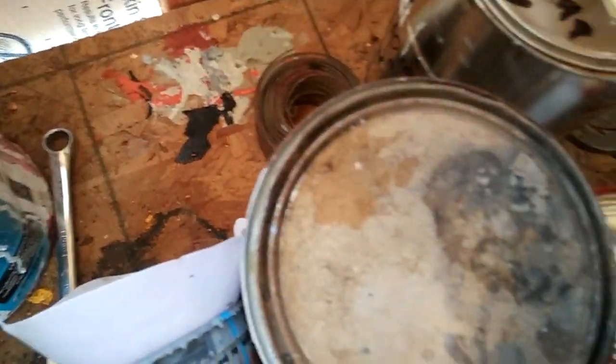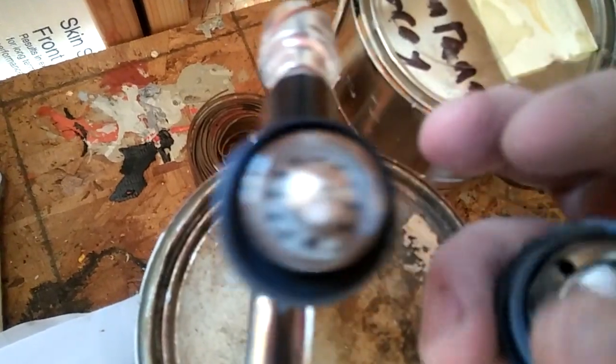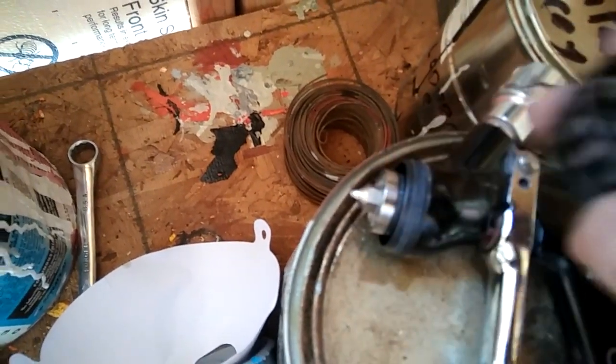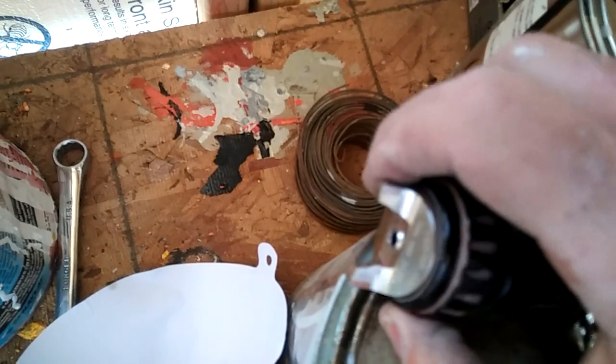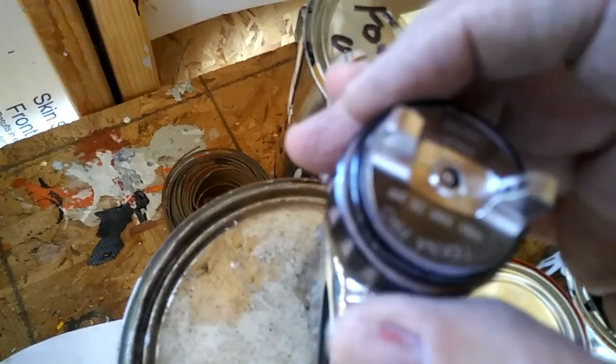Let's also look real quick at a real paint gun, DeVilbiss Tekna Pro Lite. Look at the cleaning system on this. Now, this is a $300 to $400 gun, so you're going to expect it to be better. But look how similar it is. It has the same type of spray head system, where it's a hole. And this is a non-taper on taper, so this butts up against that. So it stays clean. There are less chances of, when you're cleaning your spray tip, to have a problem.